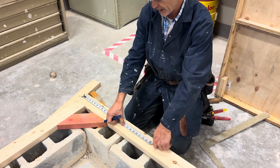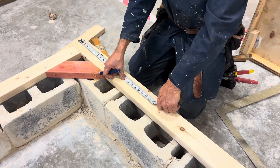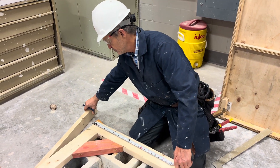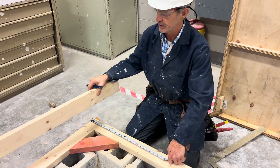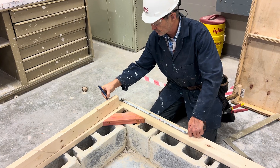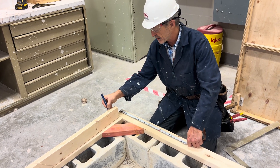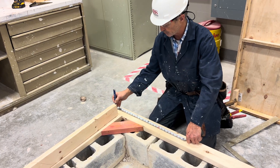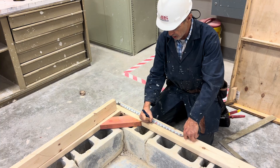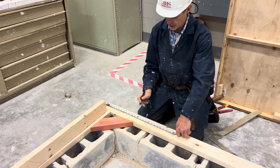We're going to go to the first red line on our tape measure. I have a whole video on how to lay out 16-inches on-center. Since our lumber is 1-1/2-inches thick — the dimensional lumber we're going to use is 1-1/2-inches thick — we have to mark the edge of that lumber. So we're going to 16-inches to the center, then fall back 3/4 of an inch. We'll hook our tape on here, go to the 16, and mark 3/4 less, or 15-1/4 inches, just like that.